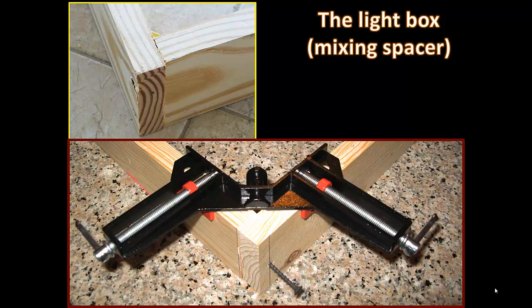So I'll say that one more time. The clamp on the right gets clamped down with that board first. Then the other board on the left gets slid in so it's a nice tight fit, and then you tighten the clamp down. Then you loosen up the clamp on the right, slide the board left or right until it's nice and flush on the end, keeping the boards flat on the surface this whole time. And then run the right hand clamp back down tight again.